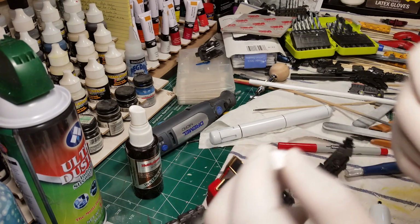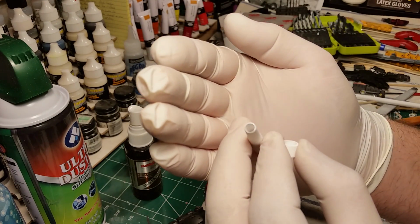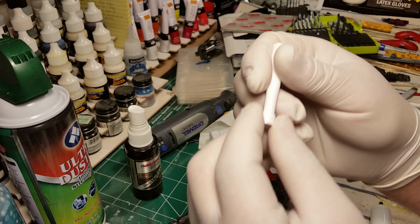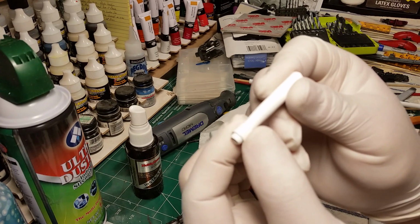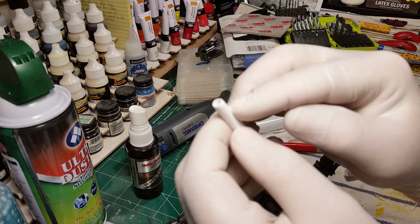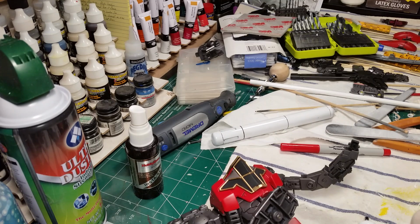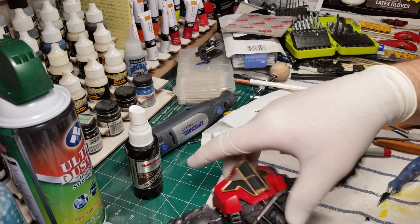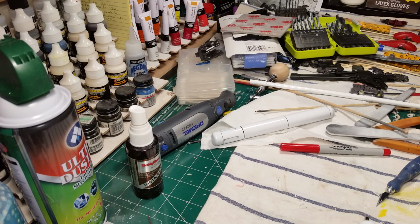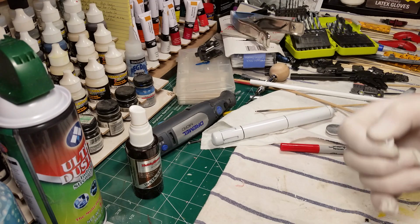I took some of that same tubing and I drilled my 3/16 hole right there. And I've been sanding this down in order for it to fit inside here, and now it does. So now what I'm going to do is cut this off right here, longer than I need it. And we'll try to do this on camera. Let me get this out of the way since I'll be working with glue. I don't want to get glue on him. My workbench is, again, a mess. When I get going, stuff gets thrown everywhere. So I'm just going to cut that off for now.